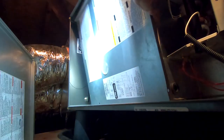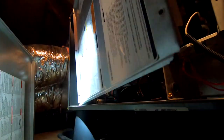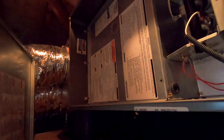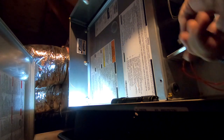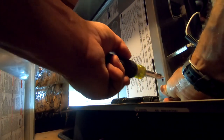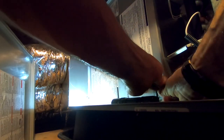I hate furnaces that are set for the minimum fan off timing. I always like to run it longer, especially when you're horizontal or downflow. I'm going to take it to one under the longest — about 150 seconds. If you want to eliminate extra problem calls later, it does not hurt to turn that fan a little longer. I've had several times where there's a big filter in a counterflow unit and the radiant heat bounces off that filter and ends up tripping a limit, causing the furnace to lock out.